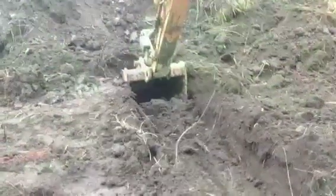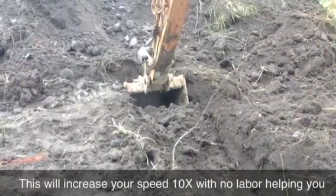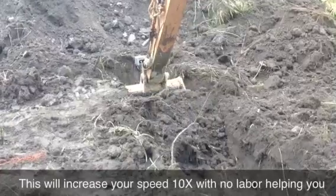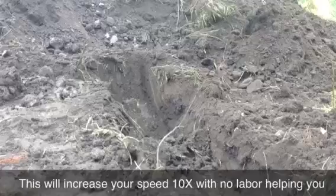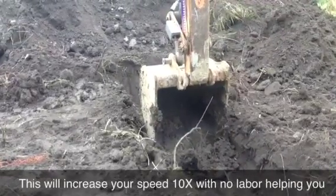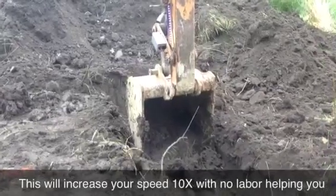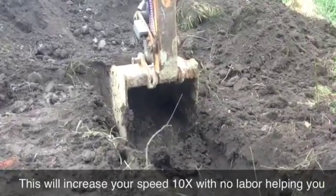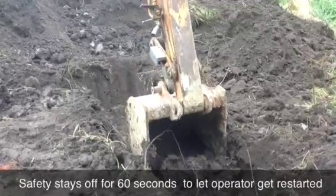I saw I'm coming up now. Big old scoop — that was a foot away at the closest. But when you're at this angle, the problem with track hoes — the pipe's right below me, right there. Stop digging is on because I'm only an inch and a half above the pipe. So I'm going to shut off my stop dig. I know I'm above it, I'm okay.